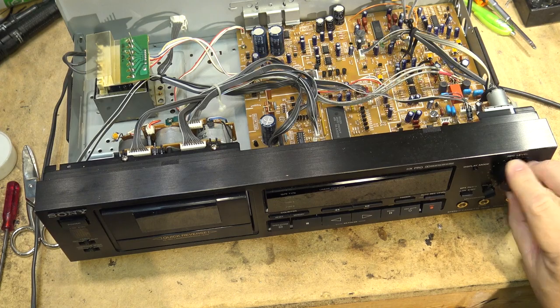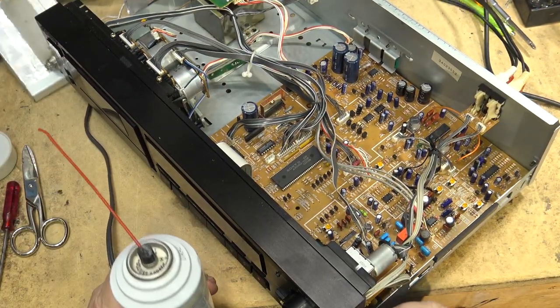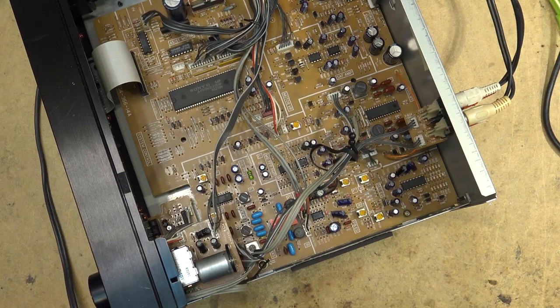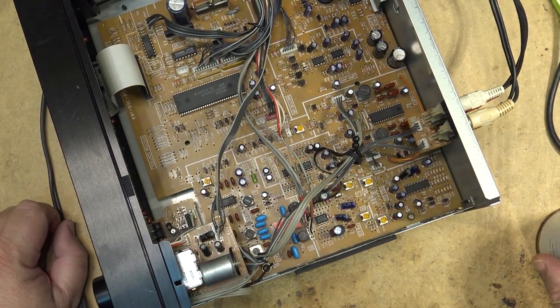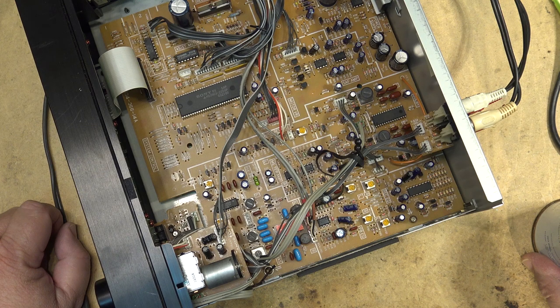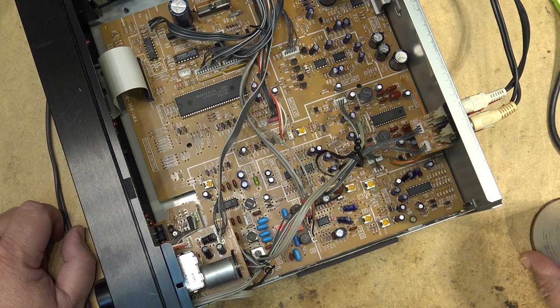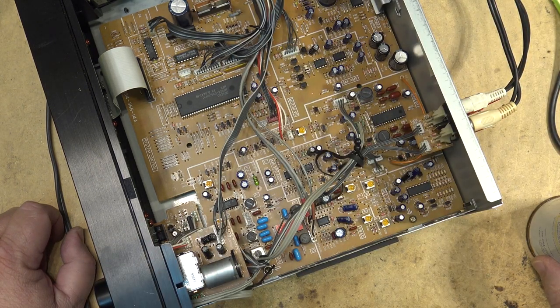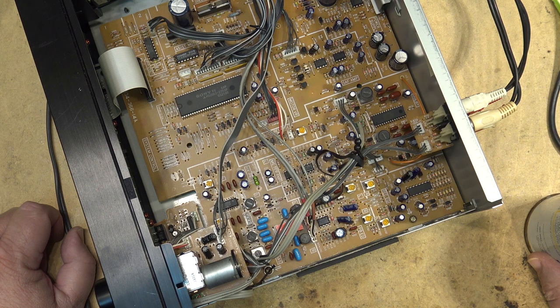I just noticed that the record level control is... And down comes my MP3 player. Yeah, when I set up the MP3 player, I wired it into my little Pioneer amp here. But unfortunately, I hooked it up onto tape 1 instead of tape 2, so that I could utilize the tape 2 output to directly record onto the camera for demoing stuff right off the tape. So I got to keep switching inputs between the CD input and the tape monitor. I don't have any loop through, so I took the secondary outputs from my MP3 player so that I can loop through a tape deck and listen to it through the amp as I'm recording. And the cable's not that long.